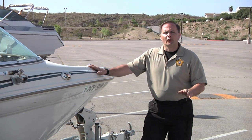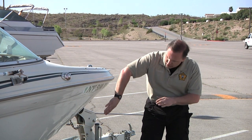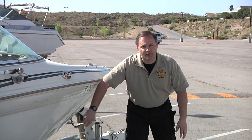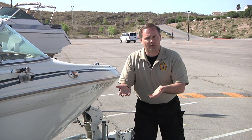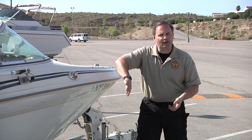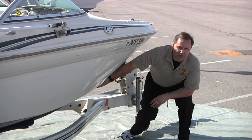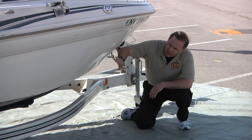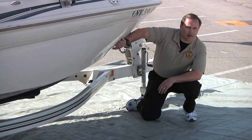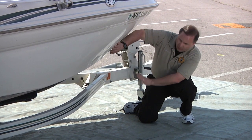When you're doing the inspection, you're going to do it both visually and tactilely — meaning while you're visually inspecting, make sure that you're also touching the hull with your hand and rubbing, because you're feeling for the mussels. You're not only feeling for the adults, but you could be feeling for the juvenile veligers and they'll feel like sandpaper. Make sure that you're concentrating — find where the water line is on the boat, go up about six inches above it, and then work your way down.